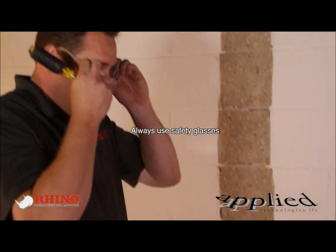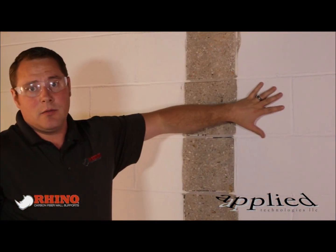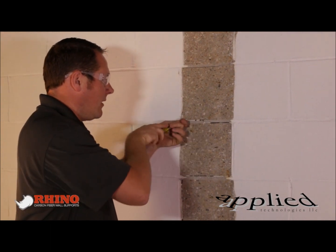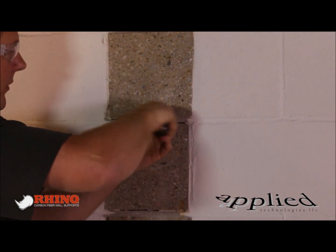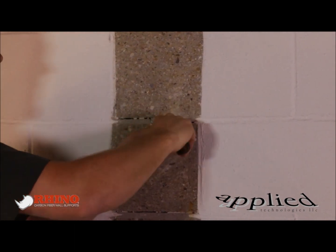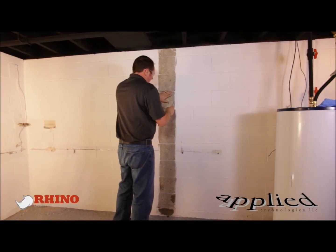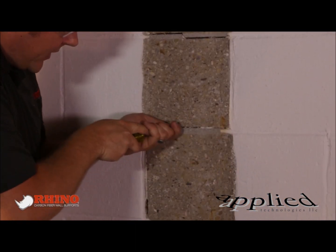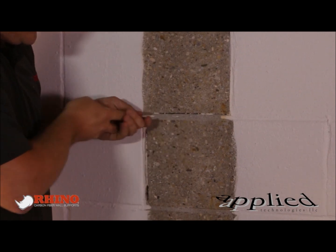Make sure we have the proper safety equipment — put your safety glasses on. We want to check the wall for any caulking. As walls start to bow, sometimes people do small repairs with a little caulking. It's very important that we remove that, because if we don't, it allows the wall to move backwards — it will never come further, but it will go backwards. These cracks we have are small enough that we don't need to do any mortar repair.